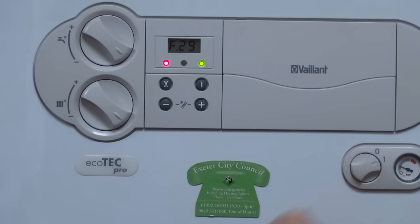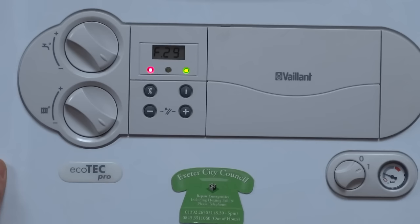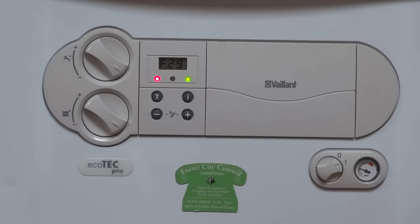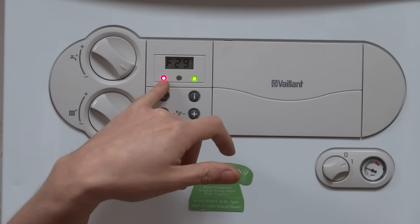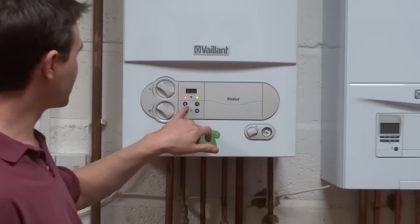As you can see the boiler has now gone to lock out. The boiler in this state is completely safe — it will not try to fire for hot water or central heating, and it's waiting for somebody to come along and reset it before it will start working again. In the digital display you'll see an F code — it will always be a letter F followed by two numbers. If you need to call us out, it's very helpful if you can take note of that number and quote it to us when you're on the phone. You can now see that the orange light has gone out and the red light has come on, indicating a fault with the appliance. To reset the boiler, press the top left hand button — the one with a picture of a flame with a cross going through it.